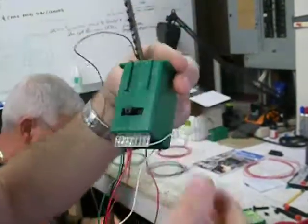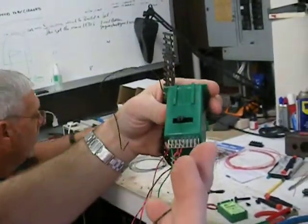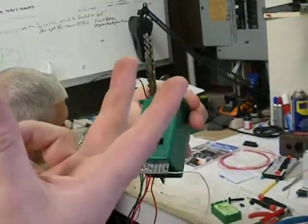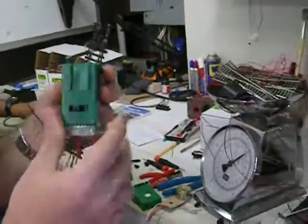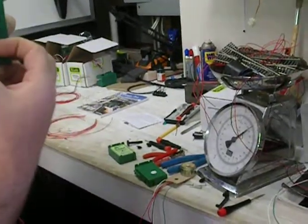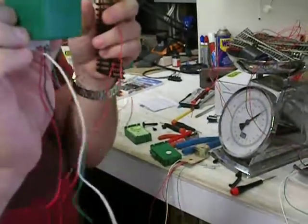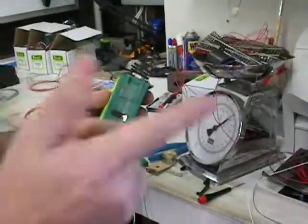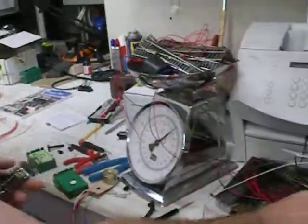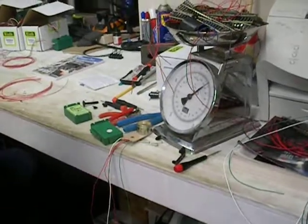But let's say there's a beam right here and instead of mounting the switch here, you have to mount it the other way. You have to reverse it and you have to reverse the black and the red, because it will be reversed as well. When you throw the switch this way it may be black this way, but if you turn it around, it won't be black — you'll be making contact with the black, but it won't be black and red. So you have to be conscious of that.